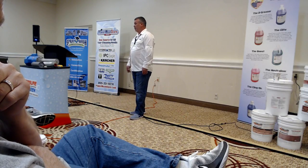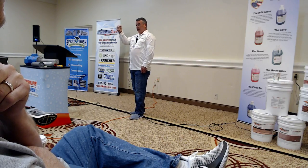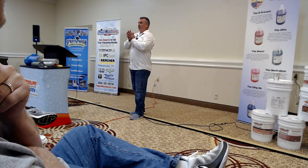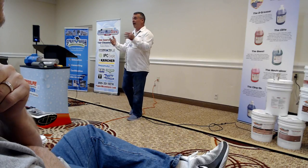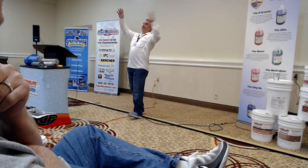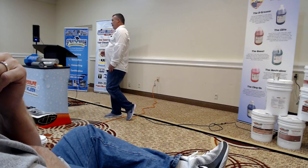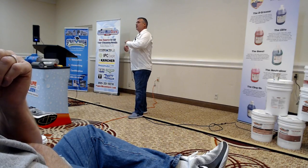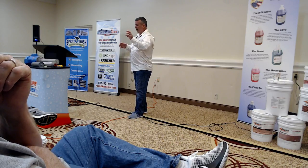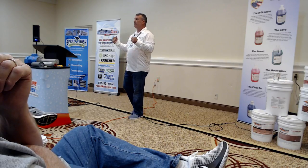Yeah, I have a two horse. My rinse pump's a two horse, and it's a beast. Raymond, 75 feet, I can hit the back of the room and knock somebody's eye out from here. But it's so much volume, it would never be an application pump. I could probably choke it down, but the PSI would probably be so high that it would just spray mist everywhere. You have a chlorine tanker in there to feed it. Yeah. But for rinse, I apply with 5 to 5.5, and I rinse with 10 to 11. So that's efficiency, right?